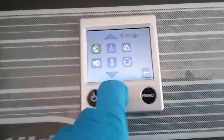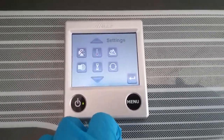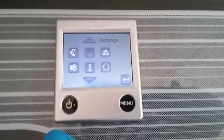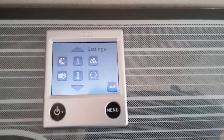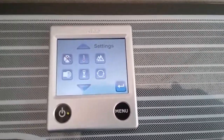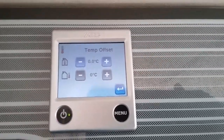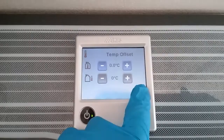If you're going to be using timers, it helps if the time and date are all correct. The next item is also an amp limiter, but you only really need to run one — I would suggest running the AC limiter on the Sargent panel over this one. The 'antimicrobial' feature allows you to sanitise the boiler. Turn it on, make sure you're running night mode as well, and at about 2–3 o'clock in the morning it will fire itself up and heat rapidly to kill off any bacteria in the system.